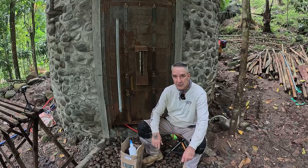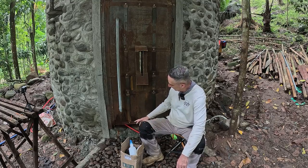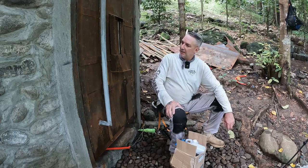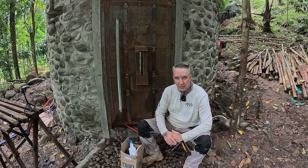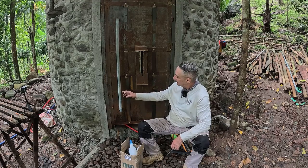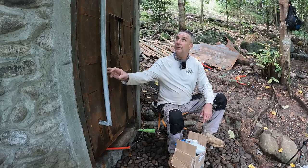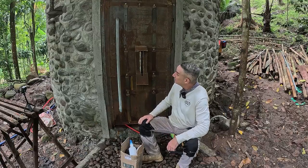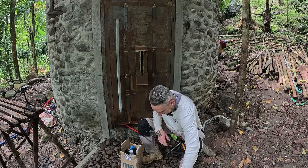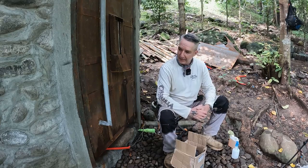We got all of our holes drilled and put our bolts in. I decided to just go with the center of the door for the bolt accents. I want to finish this door up, so I'm going to hit the handle one or two more times with the acid because it's not doing the job removing the galvanization — it's probably because this round bar just has a thicker layer of galvanization on it. I've got a new spray bottle and brought some more hydrochloric acid — muriatic acid — so I'm going to hit this.